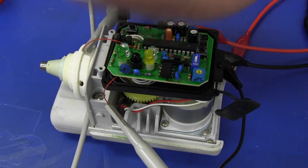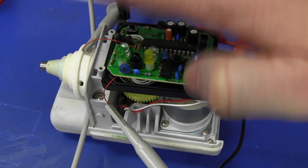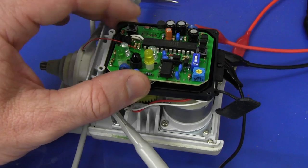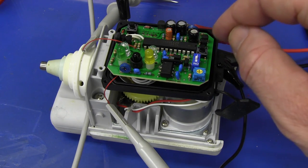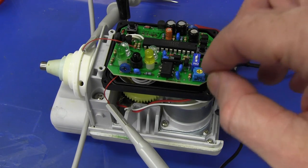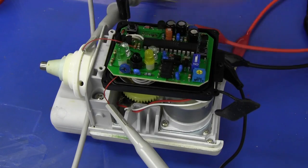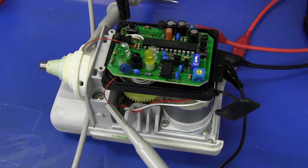Unfortunately I haven't been able to get this thing to do the business - detect anything in range and activate the motor. There's a manual flush override - there it goes. You have to wait a time period before it can do it again, but that's the manual flush override. There's another tactile switch over here which seems to reset the thing. I've followed the instructions to set the distance trim pot and the mode switch, but I just can't seem to get it to actually detect anything. You're supposed to hold it there for five seconds so it discriminates against people just walking past, but I haven't been able to get the thing working.